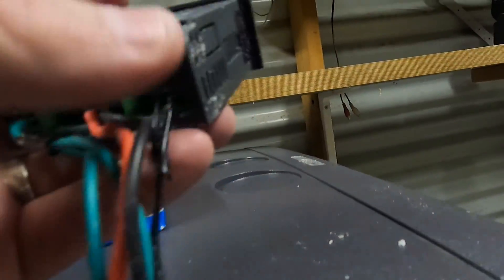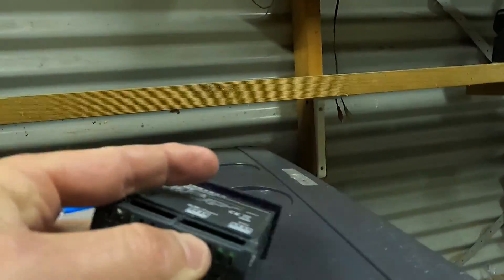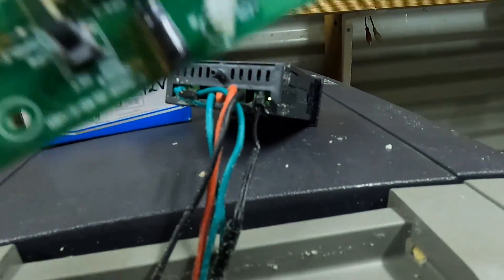Back up at the controller, the last bit I didn't talk about was the thermistor or temperature sensor that came with the fridge. It went into the back of the panel that has the LED lights on it, which was all dead on mine. So I've just cut that and put it straight in. Hopefully it's compatible with this STC1000.